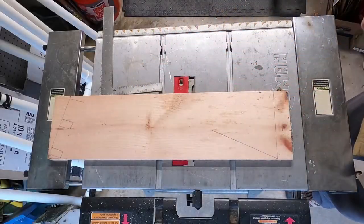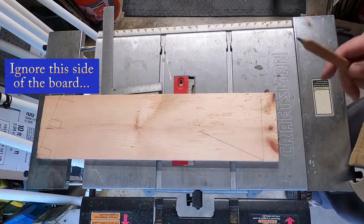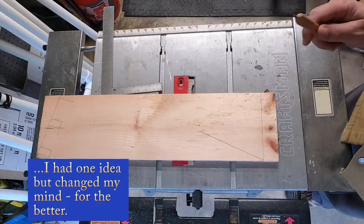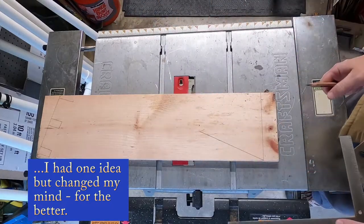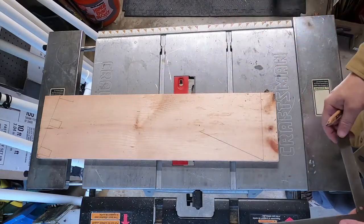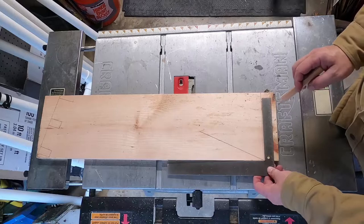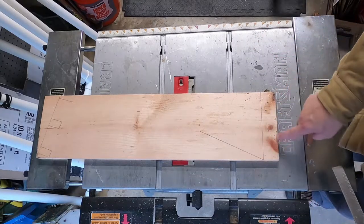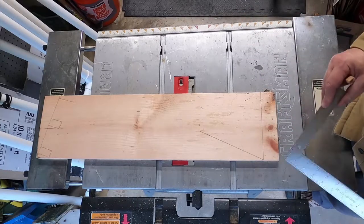Okay, so gonna build a paint rack. So what I did, I went downstairs, I looked at my old paint rack to figure out what sizes I need. And after doing all that, I'll show you how I'm going to map this out. So I just have a rough piece of spare wood here. And good woodworking practice, I drew my own level line on the bottom. Never trust the store cut because they're rarely square.